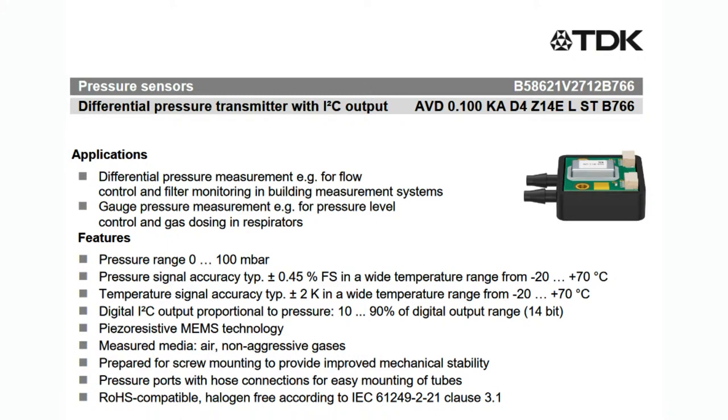Well, normally we show off non-differential pressure sensors. And those are, of course, good for if you are trying to measure pressure in a cavity. They're also good for determining altitude, how far you've moved up and down, because pressure changes with altitude. If you subtract the sea level pressure, you can determine how high up you are. So they're used for drones, robotics, watches that tell you how many steps you've taken, stuff like that. Differential pressure sensors are different.